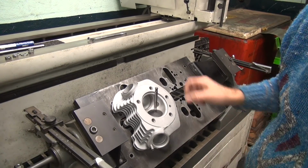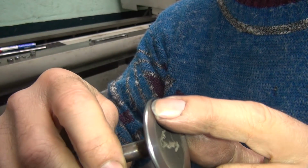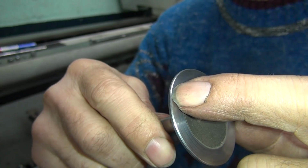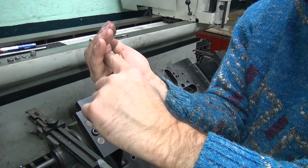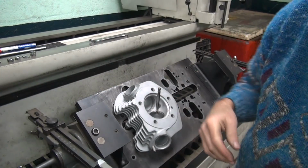Okay, finally got something that kind of works. Went almost dead flat, that didn't fly, so I came back and put a chamfer on it, just like a 45-degree chamfer by hand, so it's close. So that is a radius like this, and then it goes into an angle this way. So I'm hitting right in the radius and everything.